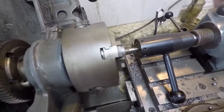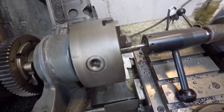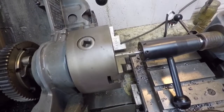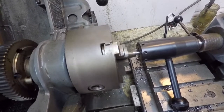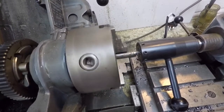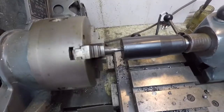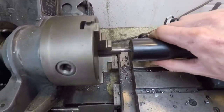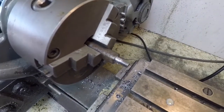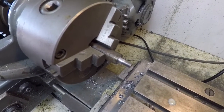The die is now cutting — you can just let it cut. I've just released the carriage lock, which I should have done earlier. It's now pulling itself onto the work until we get to the end of the threaded portion. That's now winding itself off the work nicely. And we've got our M6 thread on the end of the stub mandrel.